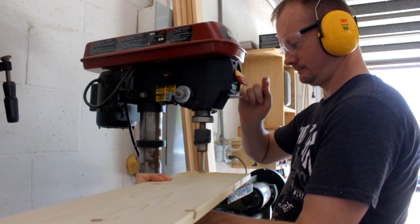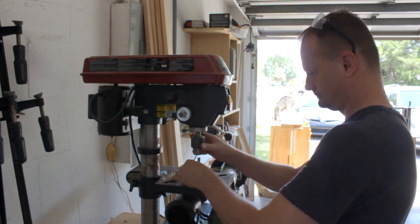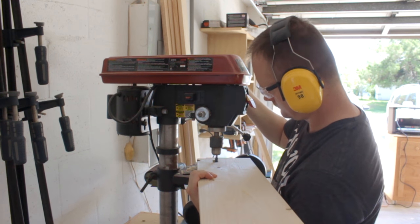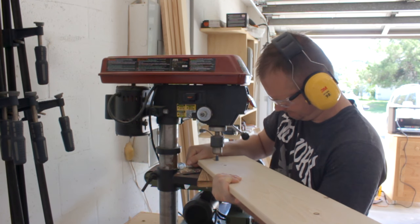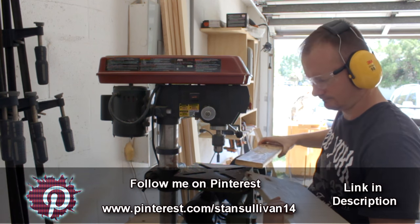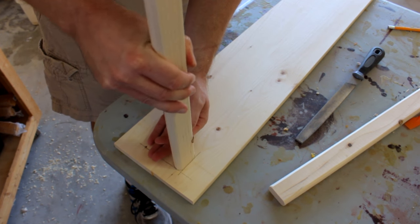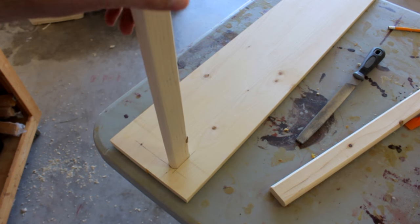I'm going to be very careful and stay off the inside of the lines I've marked, and I'll fine tune it in just a little bit. Now I can remove that Forstner bit and set up a straight router bit in my drill press, and with that I can take the material right down to my pencil line. I'm being very careful here, test fitting as I go — I did take extra time to make sure I got this step correct. When I get it where I want it, the cross bar should fit snug and I should be able to pull on it without it falling loose.